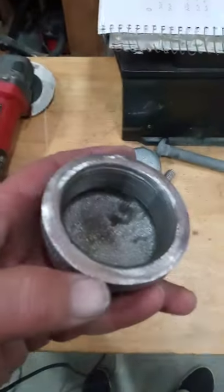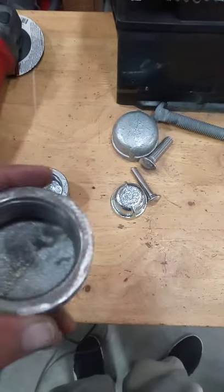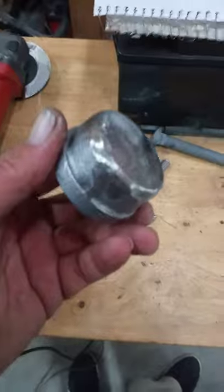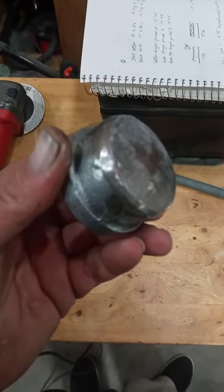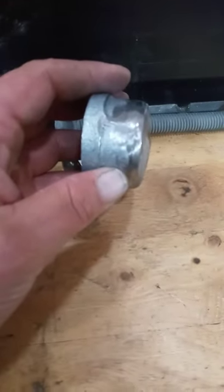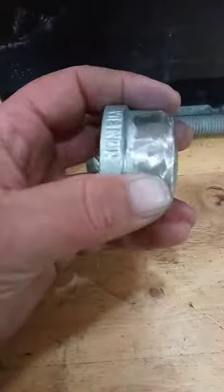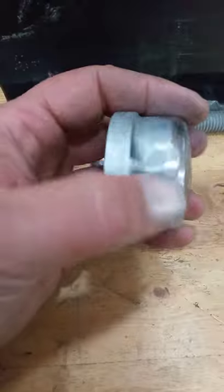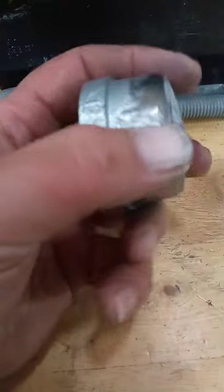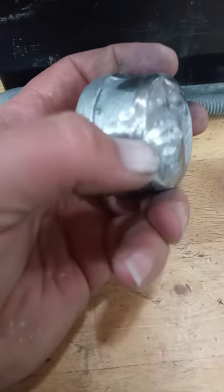I haven't got the inside bevel yet, but I did get the surface — see, all the casting marks are gone. Now this one: I've taken all the nipples off of it. I've taken all the nipples and writing and scribing off of this — there was a nipple there, there was like a UL logo, casting number — anyway, ground all that off, ground the casting marks off the face. Now pay close attention when you do this and make sure you get your edge decent. It doesn't have to be perfect, but remember: the better your tool for making the marks, the better your results are gonna be.